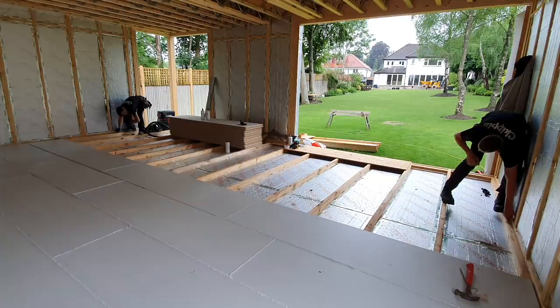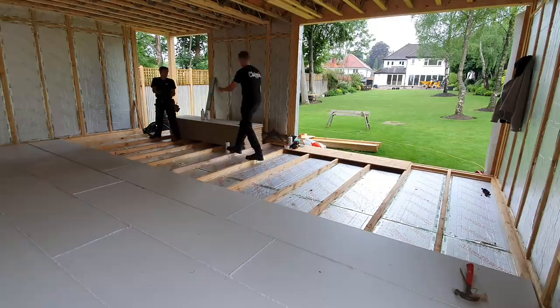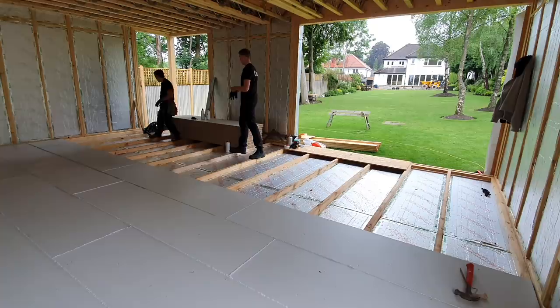Years ago, we used to put these floors down. They just had a fixing. They didn't have any glue. Glue on the tongues, just normal PVA. Yeah, you have all kinds of problems with them. In fact, one of the biggest complaints of new builds is squeaky floors. I mean, this is why we've had to adapt, and the NHBC has become super fussy, obviously, because they keep going back to repair floors.